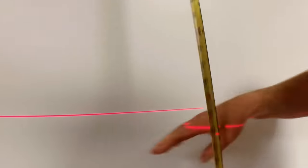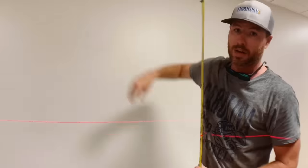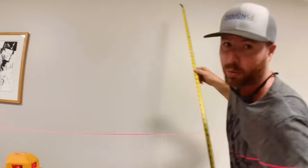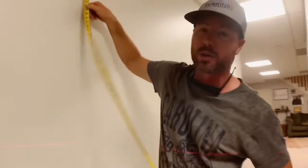Here's a quick tip about how I usually use this inside. I usually use this laser line as a reference line. I don't actually set the laser at the height of the top of the cabinets or shelves I'm putting up — I just let it shine on the wall and measure up or down from this line to the point I want. For instance, we're going to use this as a reference to see if this ceiling is level. This drop ceiling is 48 and three-quarters inches here. Further down the wall it's 48 and seven-eighths. So from those two points, the ceiling is an eighth inch out of level. That's using this laser as a reference and that's the way we usually do it.